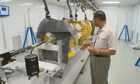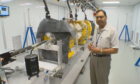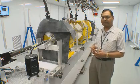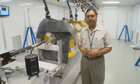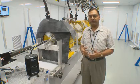Similarly, on the horizontal, three out of these four magnets are almost exactly where they were, except for one magnet which seems to have moved by about eight microns only. The tolerance for the machine is about 30 microns, and so we are still well within the tolerance of this machine.